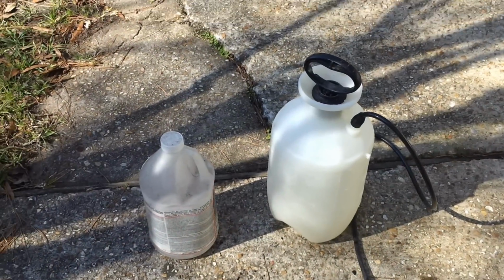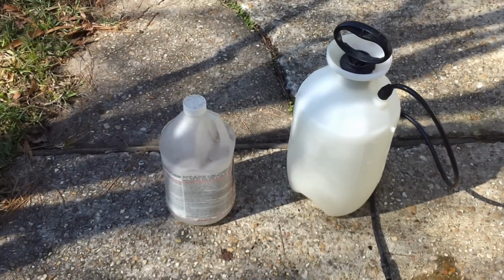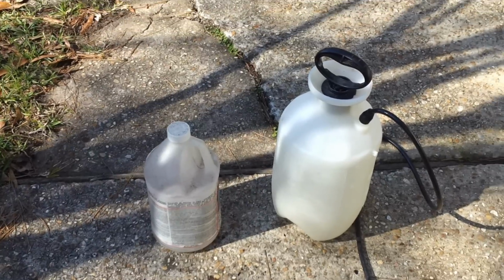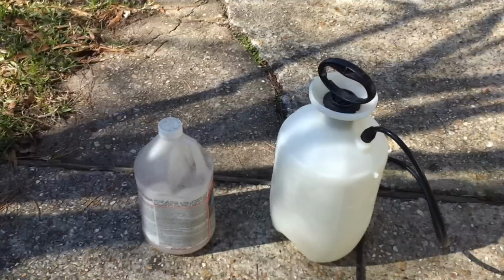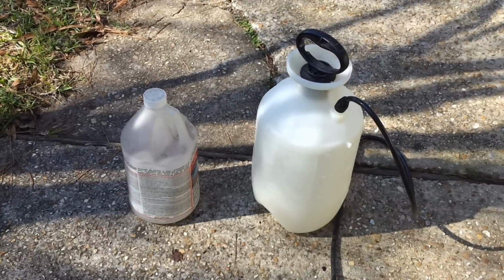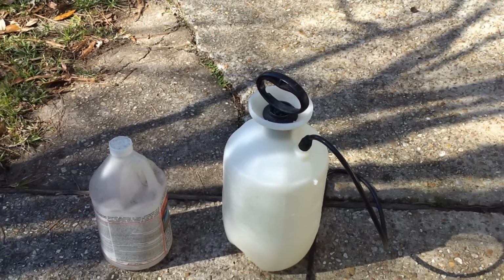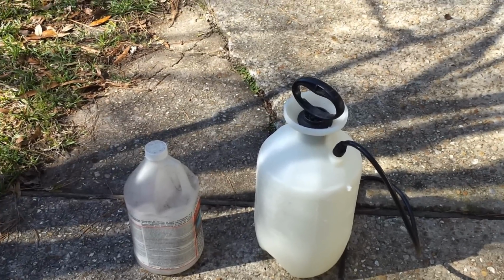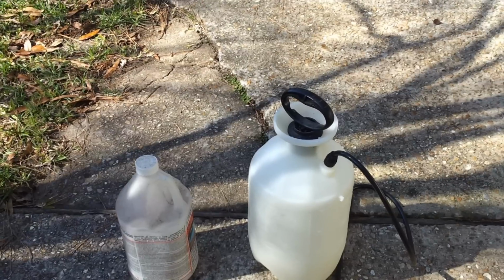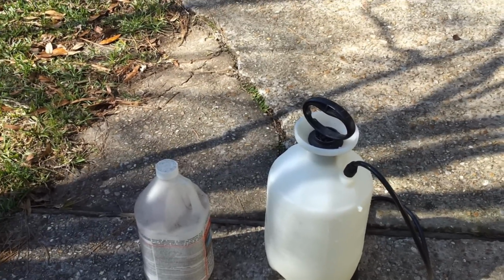Now there are several hull brightening products available on the market for you to use to clean your boat. One such product I've used in the past is called Starbright. It's actually hydrofluoric acid, and then you can cut that down to a mixture and use it in your sprayer to apply it. The Starbright or hydrofluoric acid is good because it'll get the stains out and it doesn't cause kind of an oxidation color around your stainless steel.